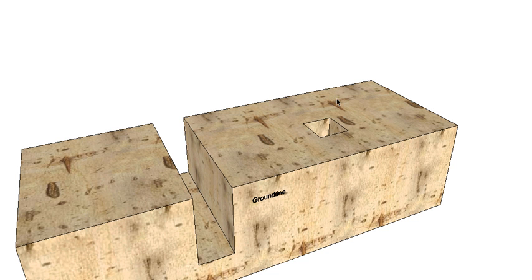As you can see I've got the ground line here, and we've dug two different types of footings. This one here is what we call a strip footing, and obviously that would run in a continuous line around the perimeter of the building. And this one here is a blob footing, and that one's just dug to suit the spacing of the bearers around the house - I'll show you those in a minute.